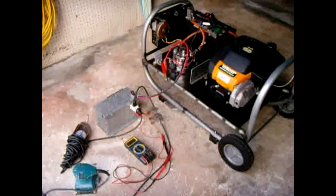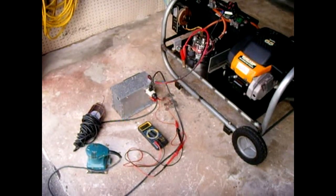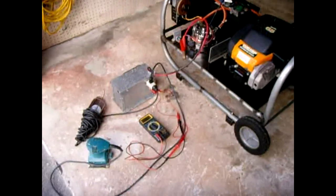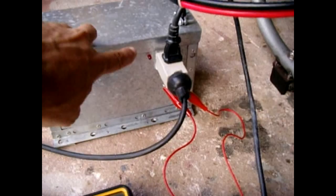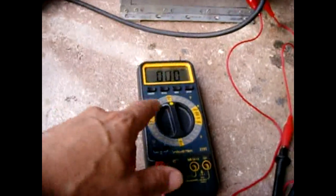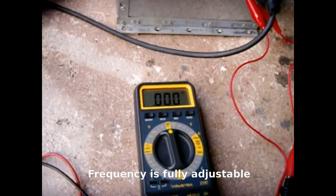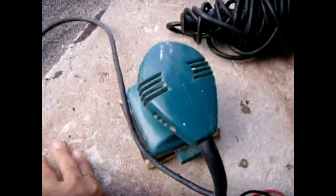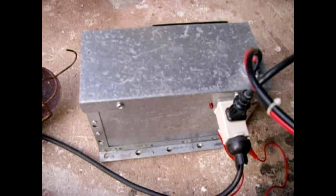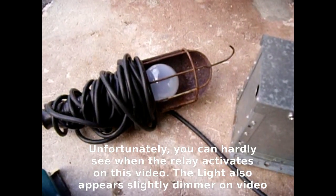There's also a video for the inverter generator if you want to see how I built that. Now I'm going to take the positive clamp from the inverter, connect it to the battery, and power up the inverter. I'll show you the power indicator LED come on. The frequency is right around 60 Hz — on the meter that reads as 0.060 kilohertz. I'm going to turn on the light and the palm sander. The light will come on slightly dimmer at first, then you'll hear a click when the inrush resistor is bypassed by the relay, allowing full current.